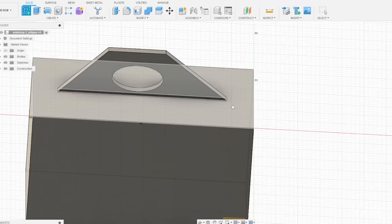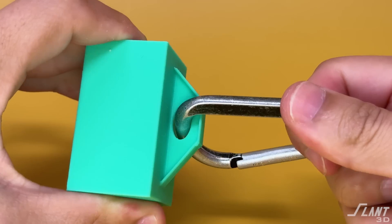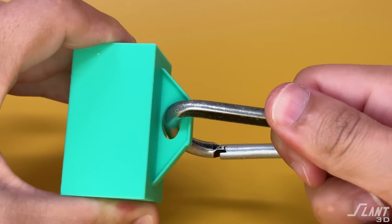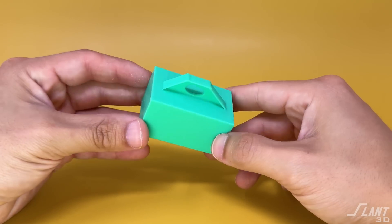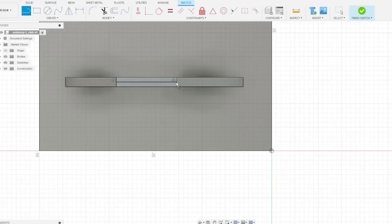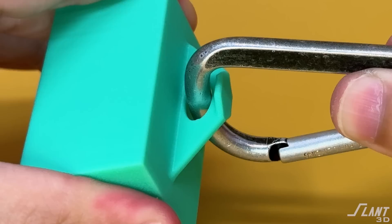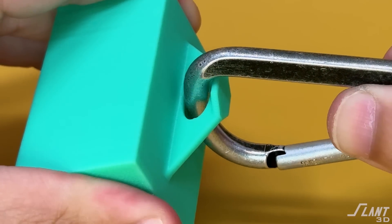There is still the potential for pullout, so if you want to reinforce that a little bit more you can take it a step further. The way I like to do this is to put a rib on the outside of the plate. This rib can act as a reinforcing factor. It can go all the way from the base of the side loop to the very top, or you can design it to be like a little T-flange on the outer edge, just adding material right at that pullout stress concentration without any issues.